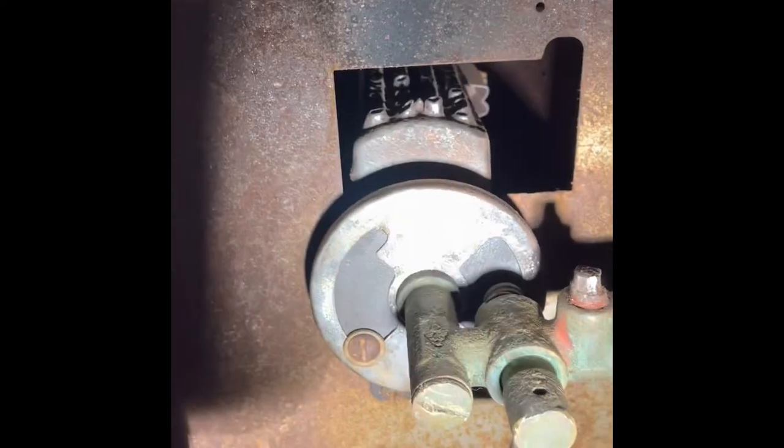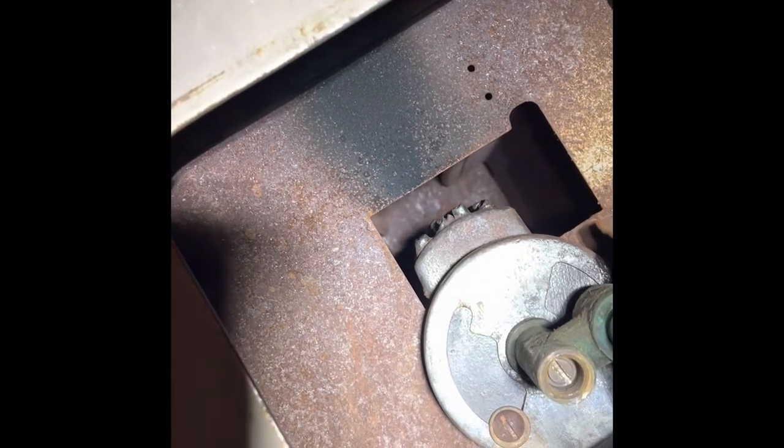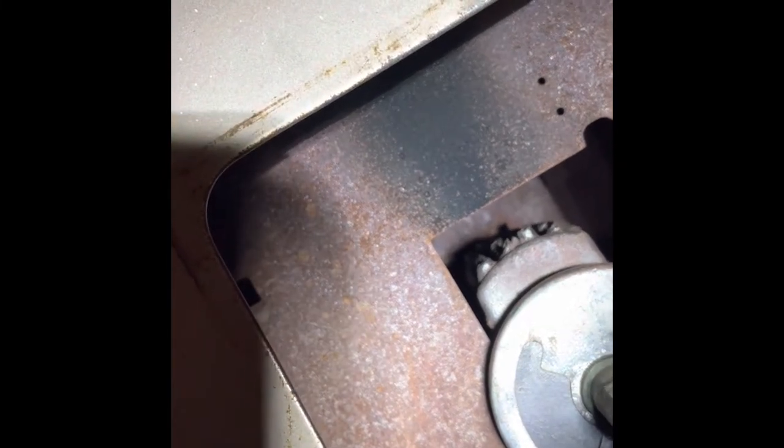This is your orifice. The orifice screw is inside there to adjust the orifice of the main gas valve. You can open it, you can close it. If it's closed you won't get any gas. If it's open too much, it'll burn and you'll get yellow flames or orange flames — you don't want that. You want blue flames. So you'll adjust the damper or the orifice screw to get your blue flames.